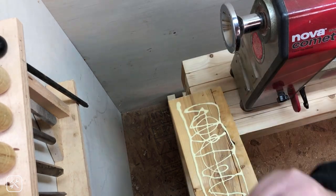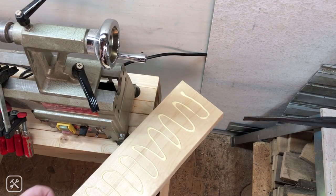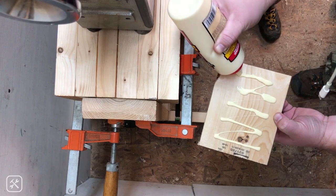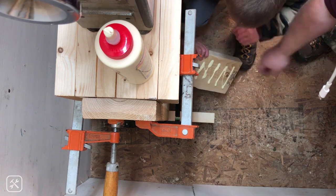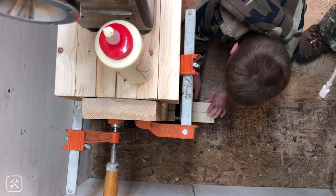With the stand in place, I then glued on outside leg boards to further strengthen the stand. I took off the inside foot boards, then cut them to fit between the leg and the outer foot rail. This design gives me more room while working at the lathe and also makes for a stronger system overall.